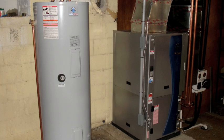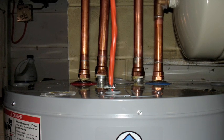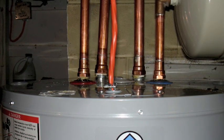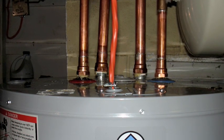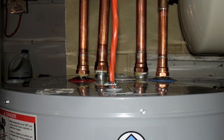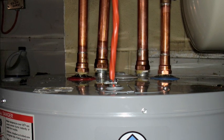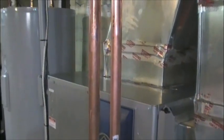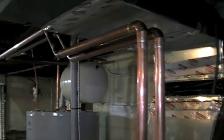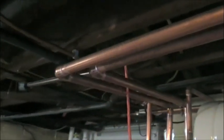How does this work? Let's look at the top of the hot water tank first. You'll notice, unlike most hot water heaters, this has four connections on the top. Two of them — the ones marked blue and red — is your standard hot water heater setup: cold intake, hot discharge. The other two connections go directly to the water furnace. Here you'll see the pipes connected to the furnace, known as the desuperheater or hot water assist. These one-inch pipes now go over to the hot water heater and connect to the extra connections we mentioned before.